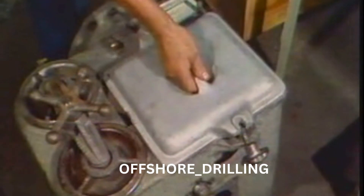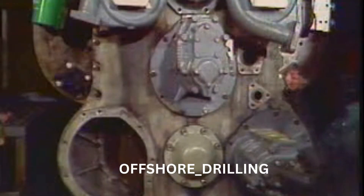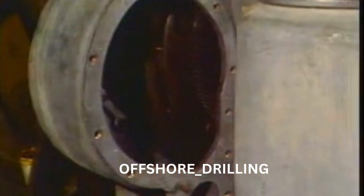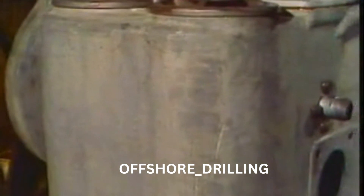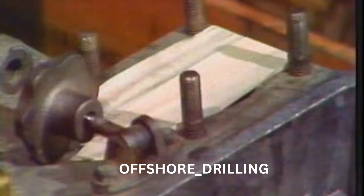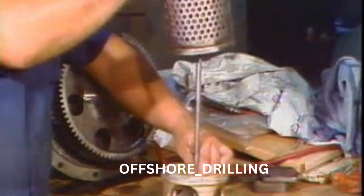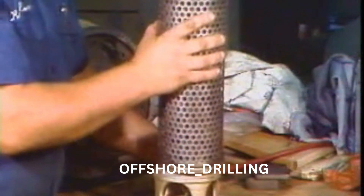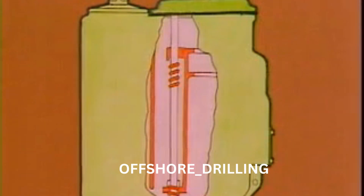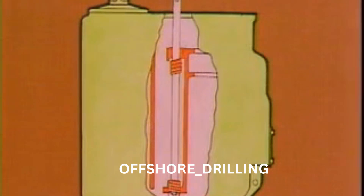This is the lube oil strainer housing — a cast aluminum box that fits on the right front side of the engine. There are two strainers for the main lube oil pump and one strainer screen for the scavenging oil pump, with a separate in and out for each system. All strainers need to be cleaned during the 1,400 hour task and whenever you change the oil. We'll start with the two main lube oil strainers. Take off the large square cover and then open the housing drain valve with a lift and turn motion — the oil will drain back into the oil pan.